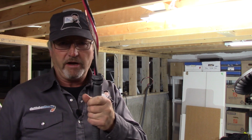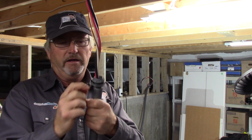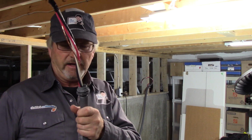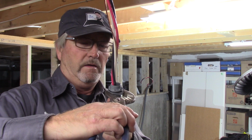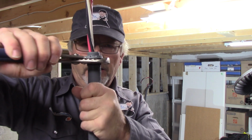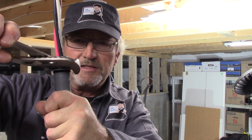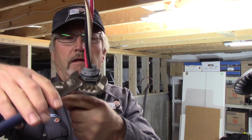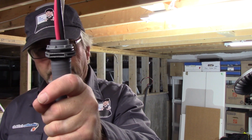So there you go. I'm just going to grab my pump pliers and spin that in nice and tight. There's a lock ring already installed here, and an O-ring gasket to make a watertight seal. And that's done, that end. So just to finish tightening that connector in, I had to get my channel lock, a little too tight to do by hand, and I don't know if you can see that. Sure you can. Right in there's another little rubber gasket that makes a seal against the Liquid-tite Flex from the connector. So you tighten that in until it squishes the gasket down, and you're done.